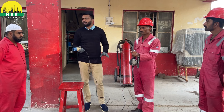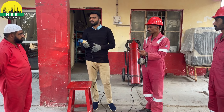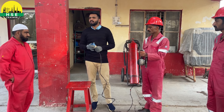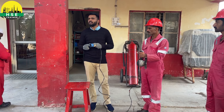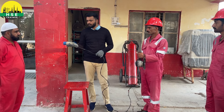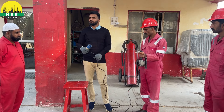What are we going to check in grinder safety? First of all, you will check the plug. The socket must be in perfect condition — not damaged, in three pins, not broken. The body is not damaged, and the insulation is not damaged. We will check the whole insulation of the wire.